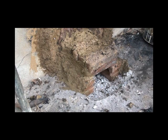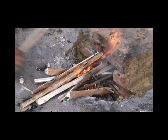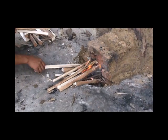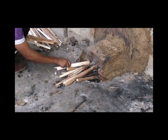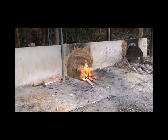A small fire needs to be started outside of the kiln in order to begin the production process. To be certain that charcoal forms, make sure that the wood inside the kiln is not in direct contact with the flames. This fire must be kept going throughout the production process, as it is the driving force behind the production of wood vinegar and charcoal. After approximately two hours, thick white smoke should begin to rise out of the asbestos chute, signaling that the wood vinegar is ready to be collected.